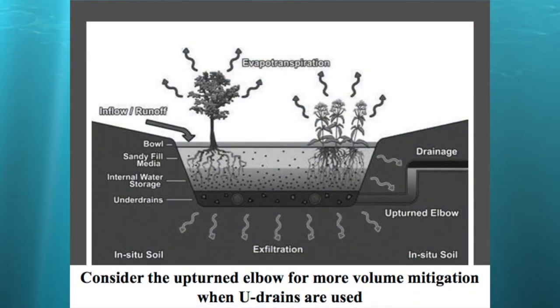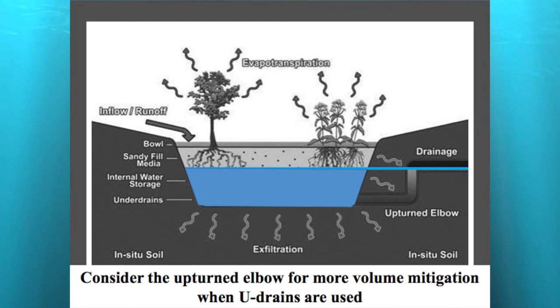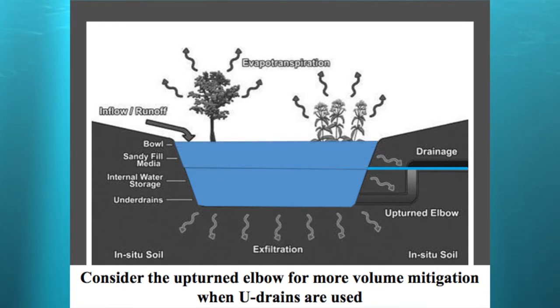One of the problems with under drains is those nutrients can come straight out. Without an under drain, nitrates will filter through the soils and get into the groundwater — that's a problem in Lancaster County with farming. Here's a schematic showing an under drain at the bottom with the perforated section transitioning to solid pipe in the native soils. It uses an upturned elbow to set the level of internal water storage — you don't want ponding water standing on the surface too long as it creates mosquito habitat and kills plants. The roots can still pull that stored water up through evapotranspiration.